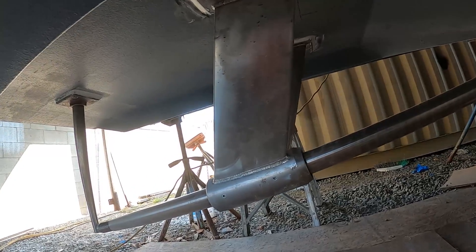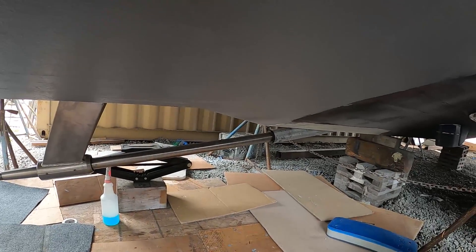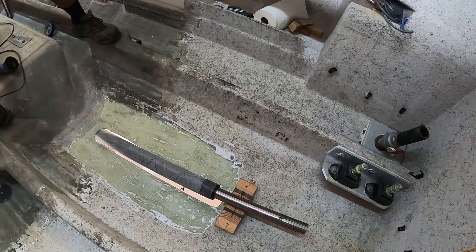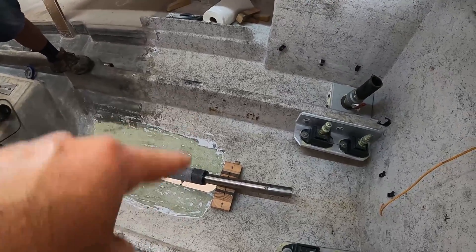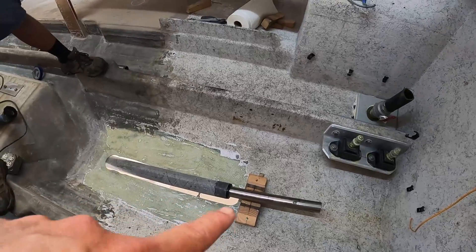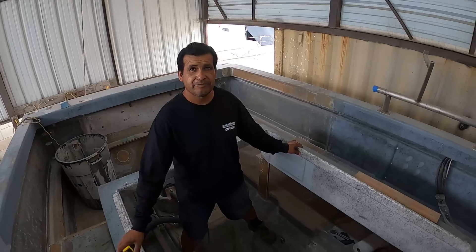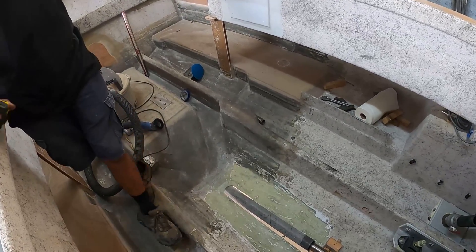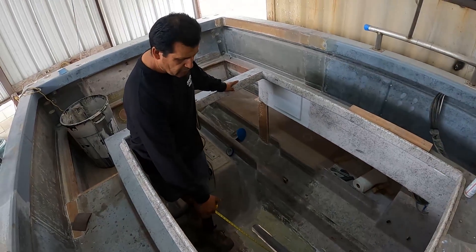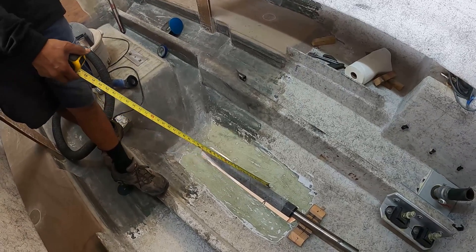Here's the completed strut. We've got the shaft set in place with the strut, and we've got some donuts that we make that hold the shaft in line with the tube. You know the shaft is sitting right where you want it because you put that block in the V-block after having the shaft bolted to the transmission. I'm going to do the bottom first and let it dry, then pour some thin Q-cell from the top to lock it in place and fill it all in. Then I'll be able to glass the top of it too.